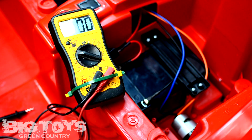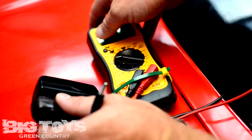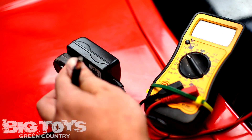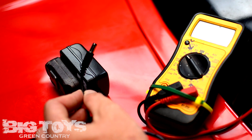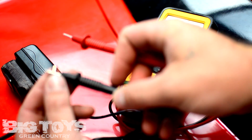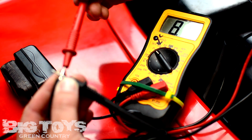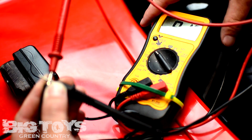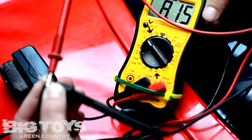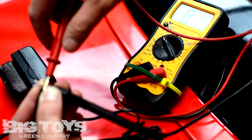Just to make sure we cover all bases, I'm going to switch this out with a six-volt charger so you can see what it looks like. So now we actually have a six-volt charger, used for the smaller six-volt cars. Here is the end that you plug into the car. We'll put it on the outside contact and then touch the inside. See right here — we're at 8.15 volts. So anything above six volts means the charger is functioning correctly and is actually charging the six-volt vehicle.